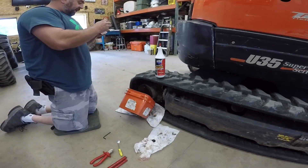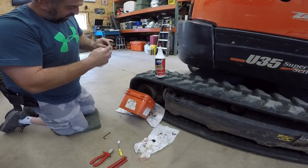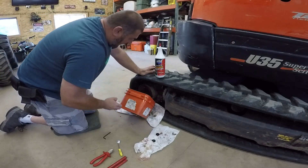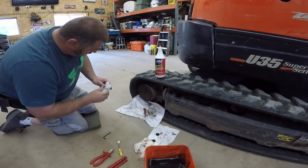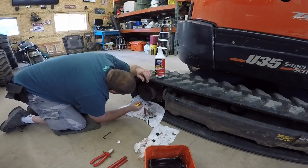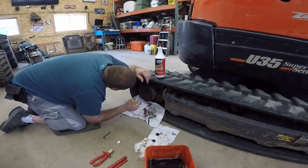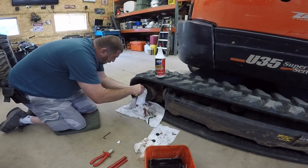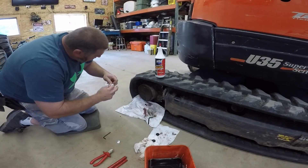Everybody wants to be a tight ass. There are O-rings on here — I clean them up and put a little lube on there for installing. I'll clean around the openings. I always use a pick to clean that out around the edge — there's no need to put debris back into the unit. Clean that sealing face off.